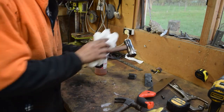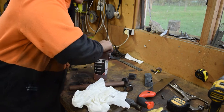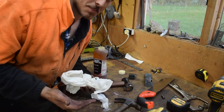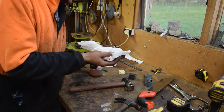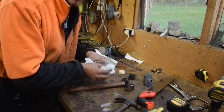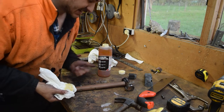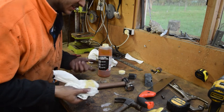Got myself some boiled linseed and we're just going to coat this in boiled linseed obviously. Boiled linseed is actually a really funny thing. What they found was linseed oil itself really didn't soak into wood very well — it did soak in and add protection, but it just took forever, like months. So what they ended up doing was boiling it — they found it soaked in much faster. Now what they actually do is use a chemical process that emulates what happens to linseed when it's boiled. So when it says boiled linseed oil on the label, it's actually not boiled — it's just got the additive in it that makes it act like boiled linseed, but for marketing they call it boiled linseed so people know what it is.